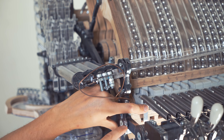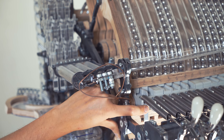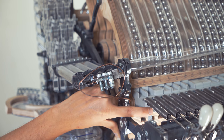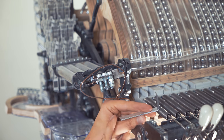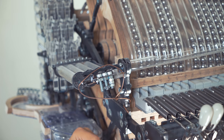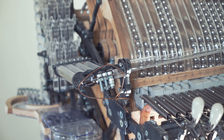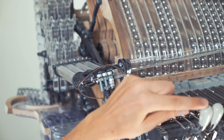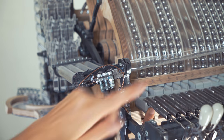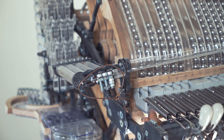marble. Now I wanna fine tune the timing of the release. I think it's slightly early, which means that we want this L hook to be a little bit longer. I found a longer L hook, and now the timing is correct. Check this. And release back. Just when this white ball knob is closing, the marble is released. Perfect.